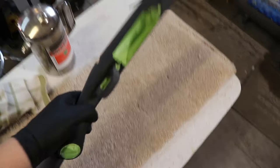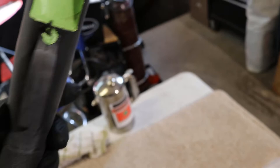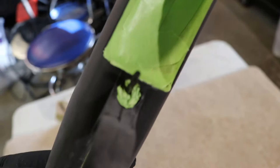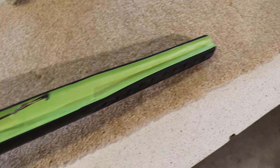I've got it all masked up. First thing I did was find a balance hole so I could put my hanger in there. Make sure you fill the holes so you don't get paint going down in there and ruin any threads. These are pass-through holes that hold the barrel on the stock. I masked the logo, the rifle sling holes, and the butt. This channel gets filled in because I don't want any paint where the barrel is going to seat — those clearances are pretty tight, and even a layer or two of paint is going to cause a problem.